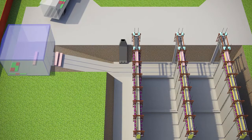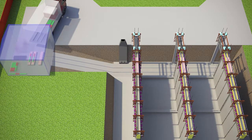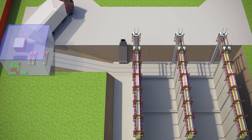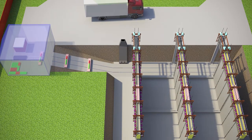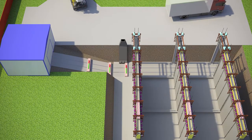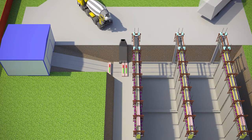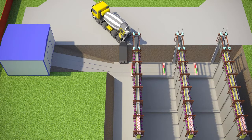Kits of armature, swivel joints, and other components to be embedded into the concrete are delivered via trucks to a warehouse at the construction site. Next, an automated warehouse management system batches the kits onto cartridge carts, which are then delivered to the desired printer for installation. An automated concrete management system delivers concrete from truck mixers or concrete mixing units located on site to the 3D printer via cartridge carts.